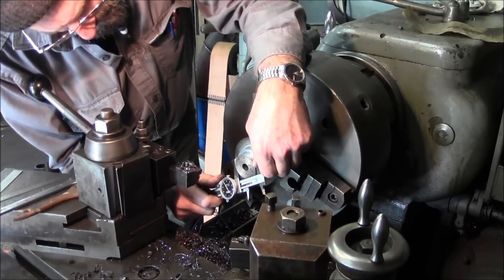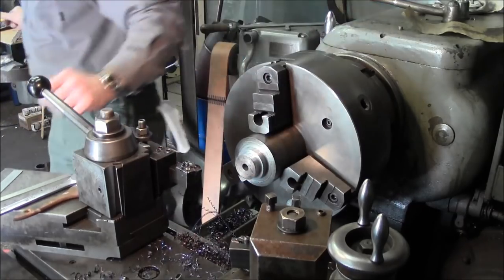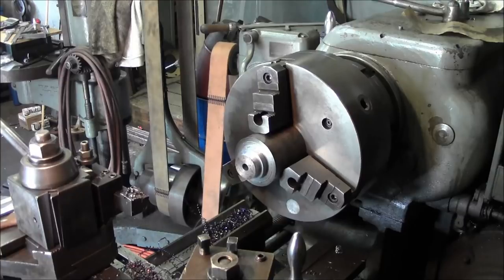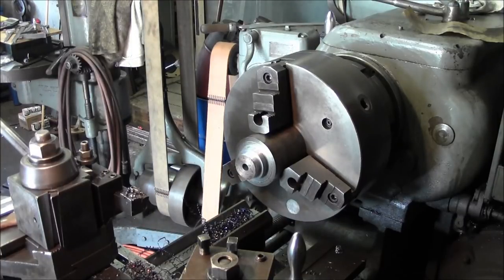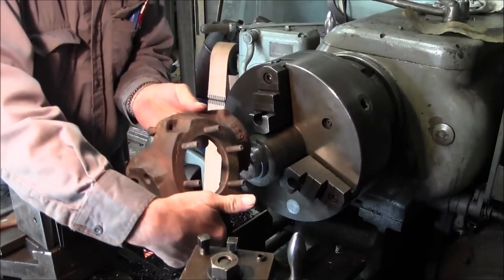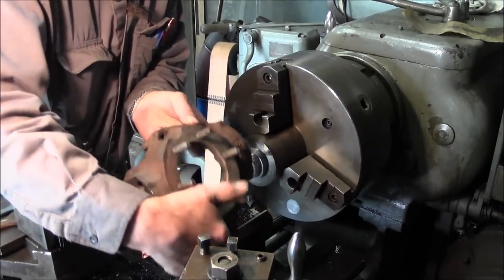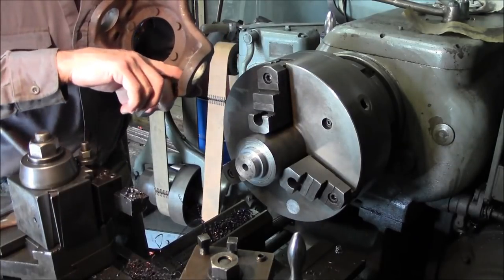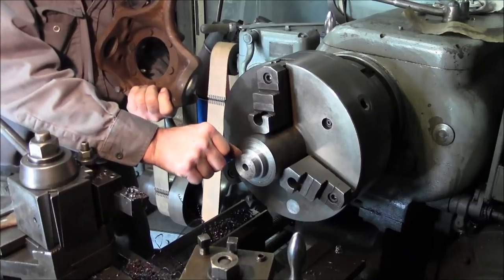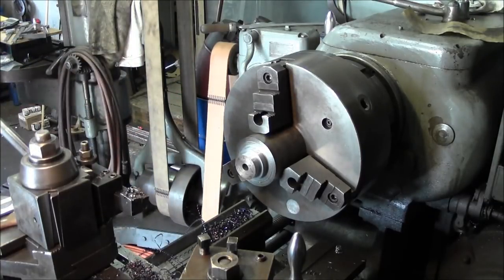Okay, 741, 742. I think that's going to be fine. Let's back this up and we'll try the hub on here. Yep. Okay. How's that? A little chamfer in there, but let's go ahead. We're going to come in there and make sure that's a real sharp root there, radius and radius, or chamfer and chamfer.